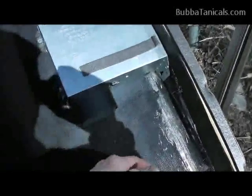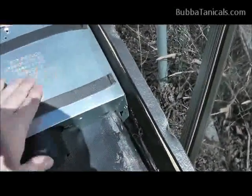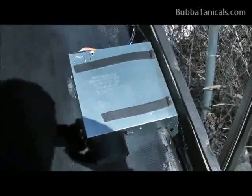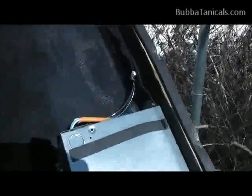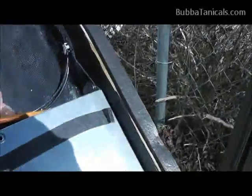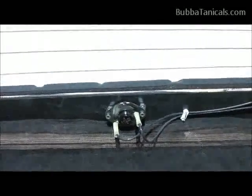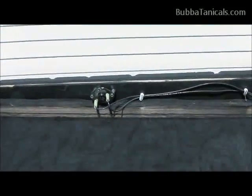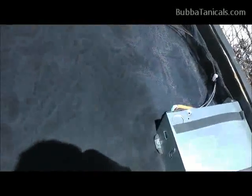What's blowing air through the heater is nothing more than a standard bathroom vent — the same kind you'd install on your ceiling. It runs about 50 cubic feet per minute and you can get them at Home Depot for about $13–15. There's a snap disk thermal switch wired in: that switch turns on when the temperature around it reaches 110°F and turns off when it drops to 90°F, saving me the effort of manually turning it on and off as conditions change.